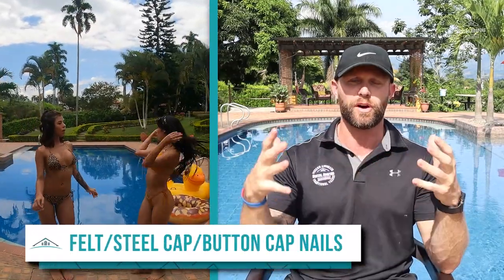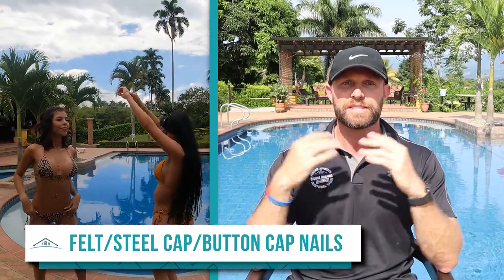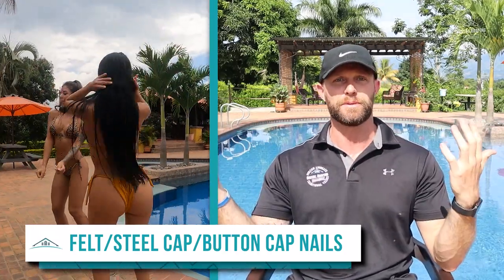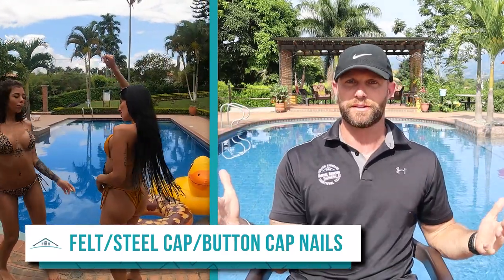Okay, last we're going to talk about felt nails, steel cap nails, and button cap nails. Now they're all basically the same thing. We use button caps, the plastic, most of the time. But these nails have many different names depending on where you live, but they all serve the same purpose, to attach the roofing felt to the deck. Almost all of these nails are composed of electro-galvanized steel. However, material is not super important because the nail will not be exposed to the elements.